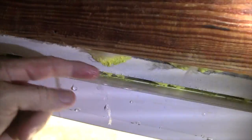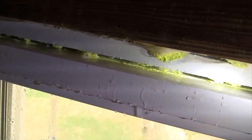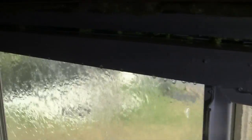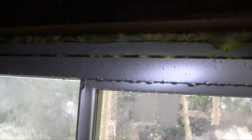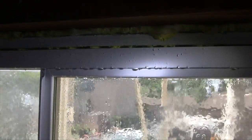It's a little wet all up in here — the entire top of this window is wet. Yeah, it's a lot of water. And again, this is between the new window and the old window. This is what happens when you don't use enough sealant between the flush exterior fin of the new window and the old window.